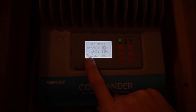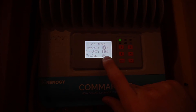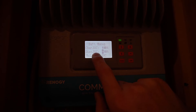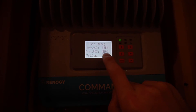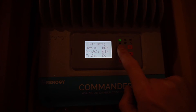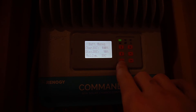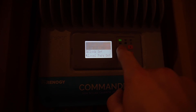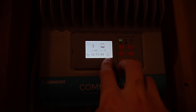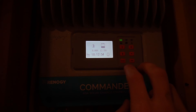If you're not running an inverter and just running solar, pick Volcom — that'll show you your state of charge. If you are running an inverter and big loads, click the SOC button according to Renogy, and set your discharge SOC to 10%. That number is when the controller will show a frown face. If I come back to my monitoring screen you'll see a smiley face — if I had it set to 50% right now it would be a frown face, because I'm below 50%, as you can tell by the line.